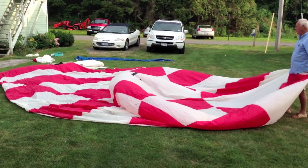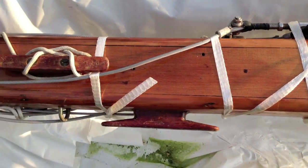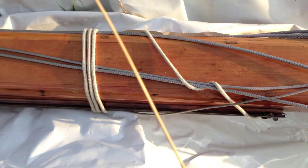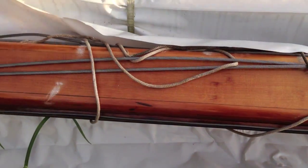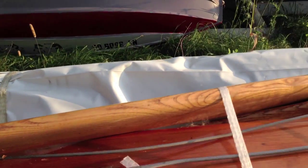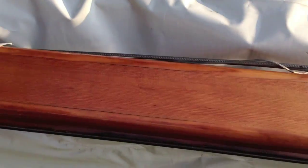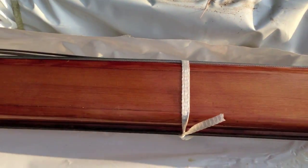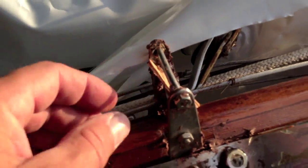Next we'll take a look at the mast. I uncovered the mast — it was shrink-wrapped over the winter, so I just cut the shrink wrap off. Moving our way up through here, looking at it, it's been varnished. I stripped it down — it had been covered in epoxy, so I stripped the epoxy off, then clear coated it with penetrating epoxy, and then put spar varnish. None of the boat has synthetic varnish — all wood on the boat, the spar and everything, is all natural varnish. Working our way up, it's all in nice shape. There's the broken jumper strut I mentioned before, which can easily be fixed.